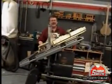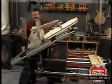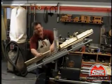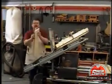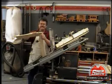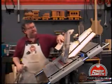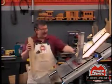All right, back to me. Okay, here are our adjoining miters. If I put these together on this table like that, the boards are joined at about 90 degrees, and they're sloped at 45. Let me do it standing up. You may be able to see it a little better. There you go. Okay? That cool? And that is how you make a compound miter. Okay? Lollipop.